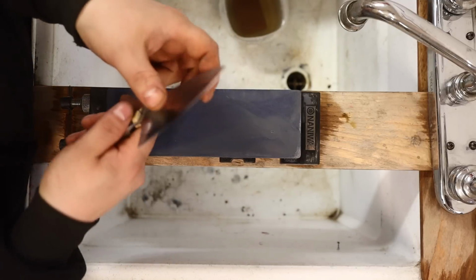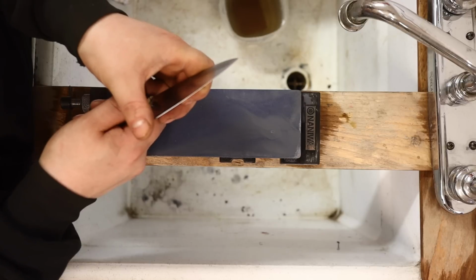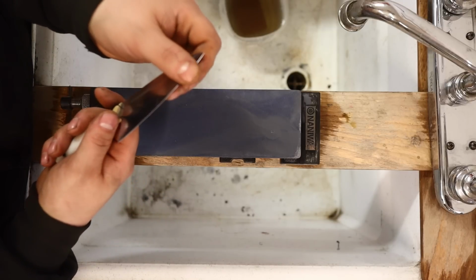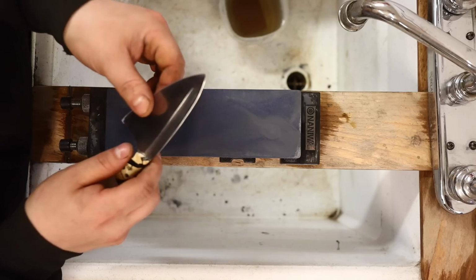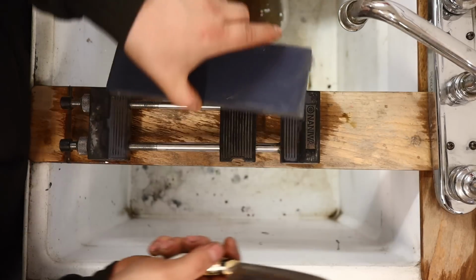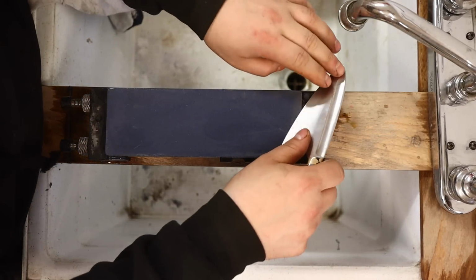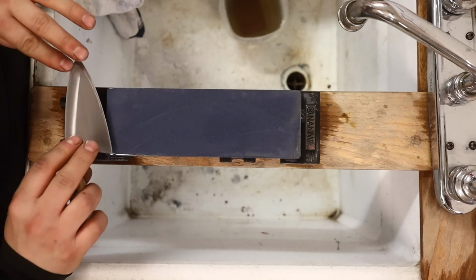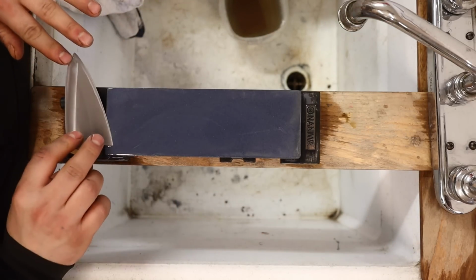And it's here, guys, on the coarse stone that most of your sharpening, pretty much all of it, gets done. Oh, that's such a coarse bite. So, yeah, there's a little bit of burr now pushed to the other side, but much less of a burr. We'll do just a few single light cutting strokes. The edge off of this 300 or so grit stone alone would be an incredible performer in the kitchen, because most of your sharpening happens here.